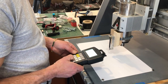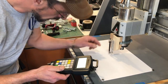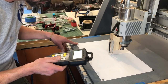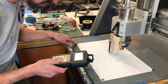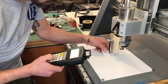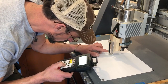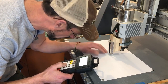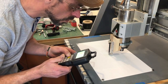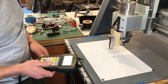I'm using a design that's already set up. The center of the design is actually the center of your material and not in the corner. If you have a corner origin, set your pen point over there for your origin. The Z axis is real simple — just bring it down until you have the spring depressed about a sixteenth of an inch. That'll do you. My origin and Z axis are set.